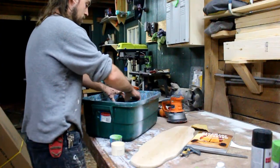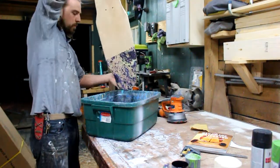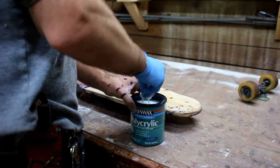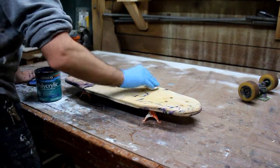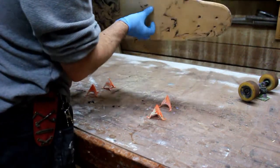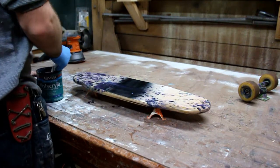Now is the time to apply your clear coat, but before you do that, if you want to apply any artwork go ahead and do that first. For this project I chose to do a very simple hydro dip — I'll have a link in the description and at the end of the video. Because I used water for the hydro dip the wood is just a little bit wet, but that's okay — I can finish with a water-based polycrylic, which is a water-based polyurethane. Water-based polyurethane prevents yellowing, which is good because this plywood will tend to yellow over time. I'm applying it by the wipe-on method, thinned slightly with water, applied liberally to the surface.